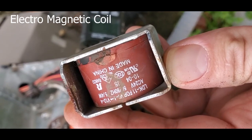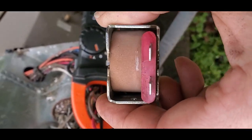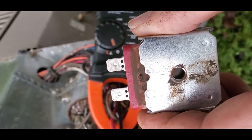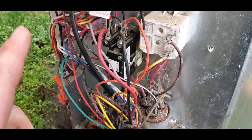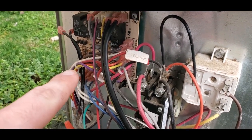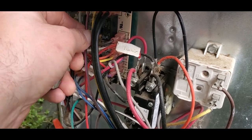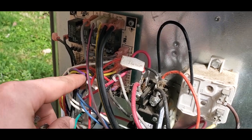We've got a leaking reversing valve — 24 volts, made in China. Looks real rough. And that right there is the two male spade connectors. I plugged it back up. Of course you don't hear the terrible noise, but there's no coil on there, so it's not going to make the noise any longer. This is a heat pump condenser. It's got a little defrost board, and that defrost board has the pressure switch in and out, the M that goes to the contactor, and the relay for the outdoor fan motor.